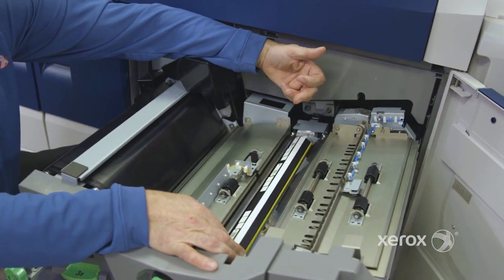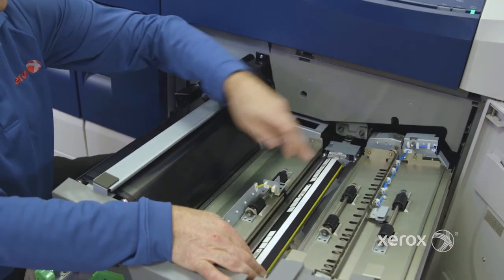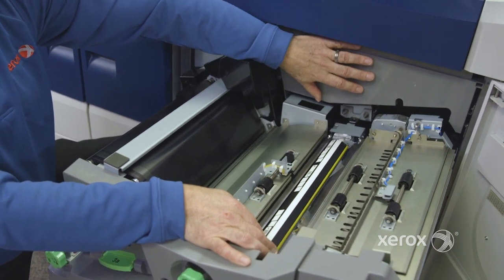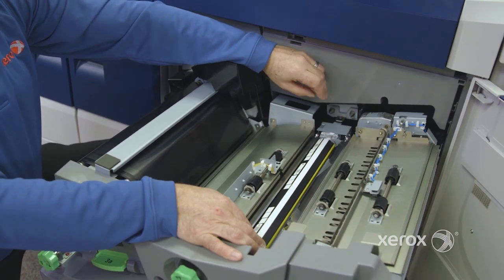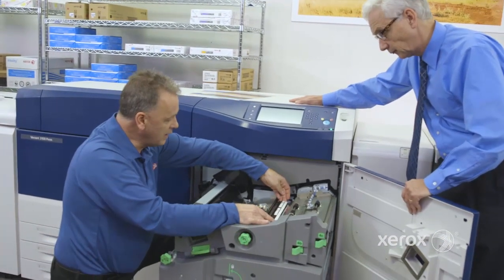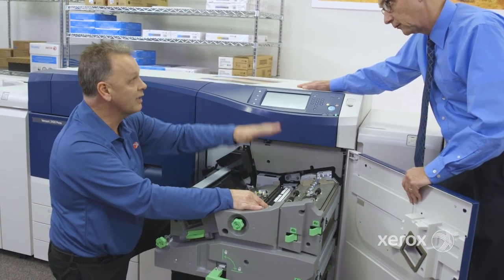Because the paper is not always white. It can be bluish, could be yellow, could be porous. We want to make sure that we know what the white is. So we measure this from inboard to outboard, and this information is sent to the FWA scanner. So that gives me my white point, and then I can compare any reading to this white point after a while. And then we move to this location here, and we want to make sure that we know where the paper is, height-wise.